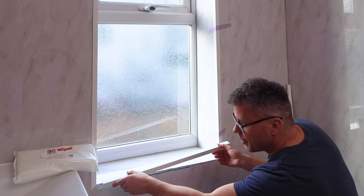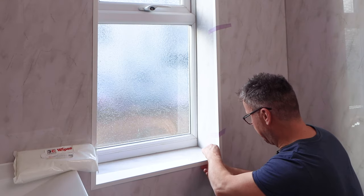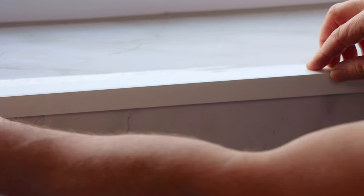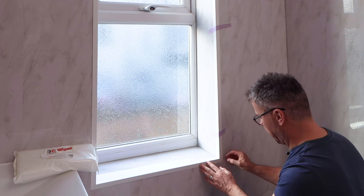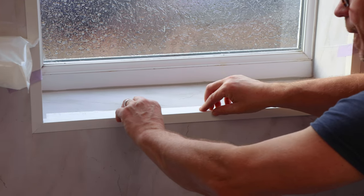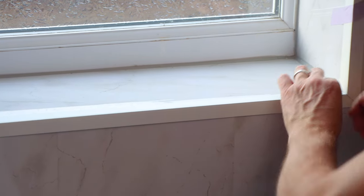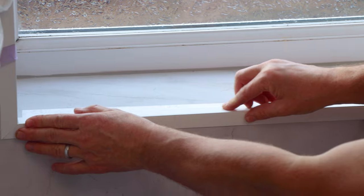This can be placed on nice and gently — in one corner, lower down into the other, just gently press it into position making sure that it's in line with this corner and this corner, because we've got them fixed temporarily in the right position. Pressing it down, you might get a little bit of adhesive oozing out, but I think I've got just enough on there — it's not actually oozing out anywhere.